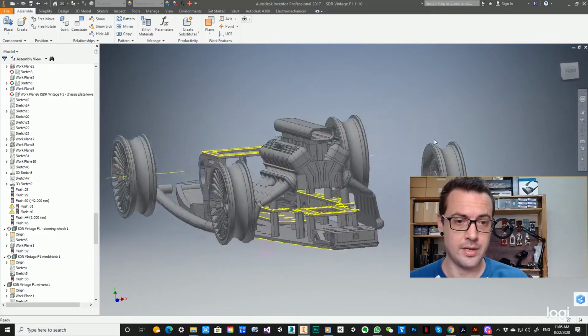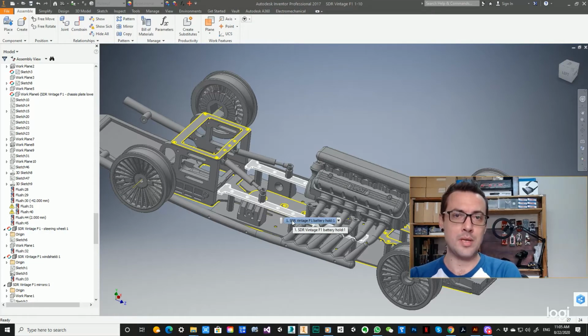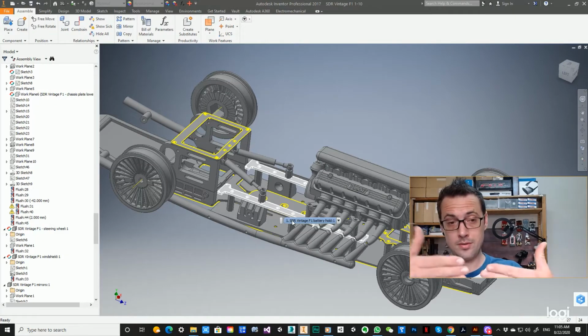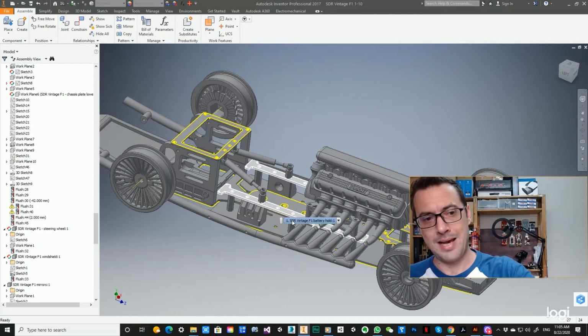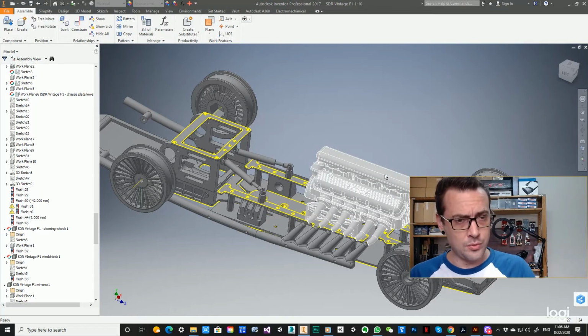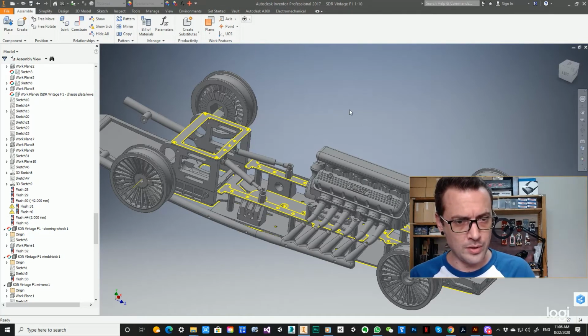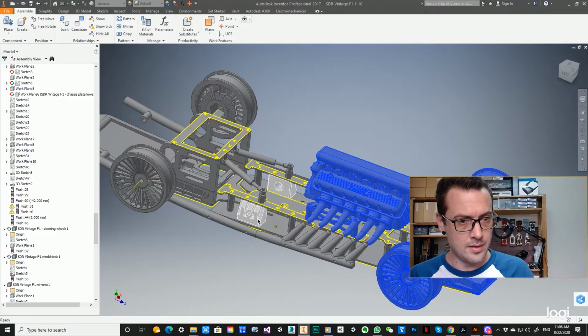I am now ordering the first prototypes. All the plates are going to be 2mm thick, and I have my pods already. I'm testing something new for the pod: a motor spacer for the cooling, as well as to have the motor spaced away enough from my bearing mount. If you know the pod, you know why you need to have a spacer at the back. And I'm trying as well to get some cut out in 2mm material instead of having them 3D printed. And so all of these parts are going to be the plastic parts.